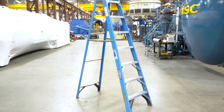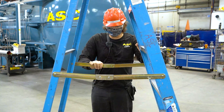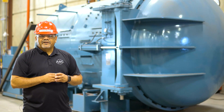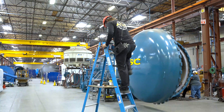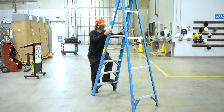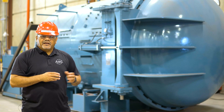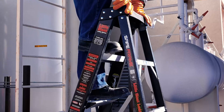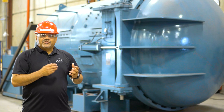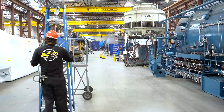Now let's take a look at A-frame ladders. A-frame ladders look like this and are among the most common ladders you will see and use. Whenever using an A-frame ladder, make sure that each middle arm support is locked and the ladder is level on the ground. 20% of step ladder injuries come from descending down the ladder and missing the last few steps. So when you are getting off the ladder, make sure to take your time. Keep at least three points of contact and ensure to make it to the last step safely. Do not rush yourself off the ladder — an extra few seconds can be the difference between a job completed safely and a long-lasting injury. Do not stand on the top two steps of an A-frame ladder. The use of those steps will make the ladder top heavy and more likely to tip. If you think you need to use the upper steps, then the ladder you are using is too short for the job. Locate a taller ladder to use for the task.